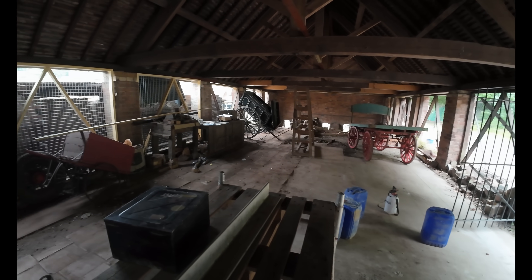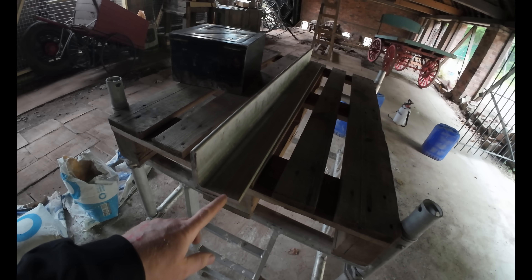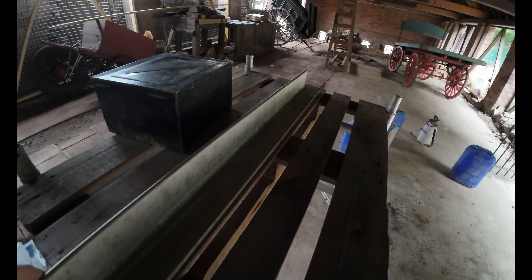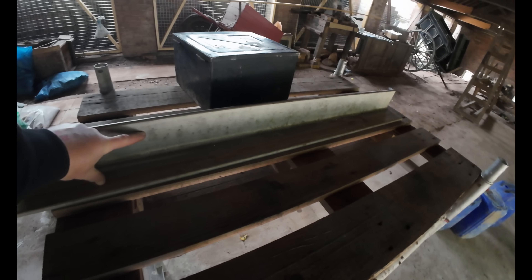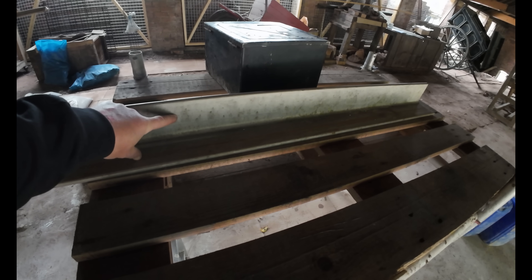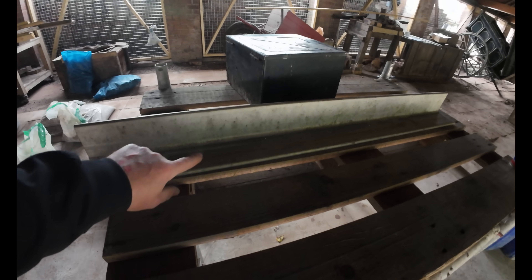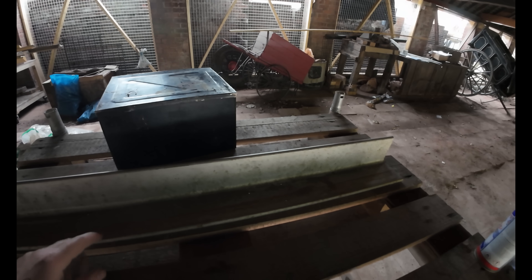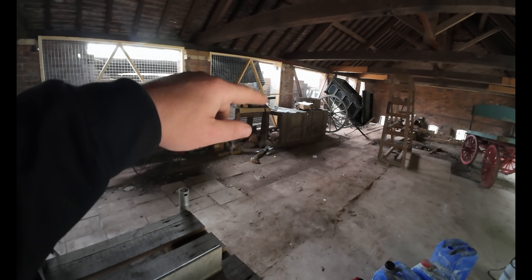There are worst places to work in the world. I've got some stainless out in the yard that I brought down - 100 by 100. The architect wanted 8 mil but we had 10 mil so we're going with 10 mil. This is going to sit underneath that purlin and we just need to put offset two holes by 50 mil. I think that's M16 going in there so we'll probably drill them at 17 mil if we have a 17 mil tungsten carbide bit, because you can't drill this stuff with a standard mag drill bit. If not, we'll just drill them at 18 mil.